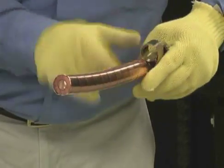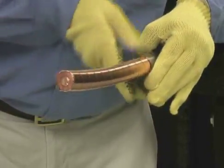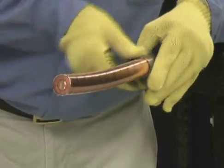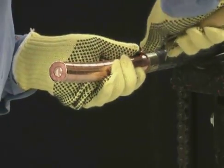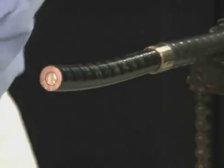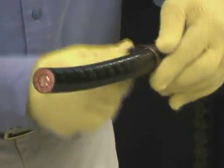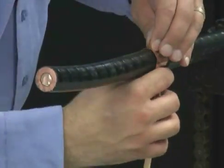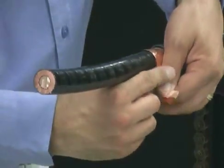Make a mark on the tape shield at the proper dimension and apply a spring clamp aligned with the mark. Use a knife to create an edge to grab, then use needle nose pliers to grab the edge and peel back against the spring clamp to remove the copper tape. Use caution as there will be sharp edges exposed. Remove the spring clamp, then apply a copper tape strip or vinyl tape to cover any sharp edges and hold down the edge.